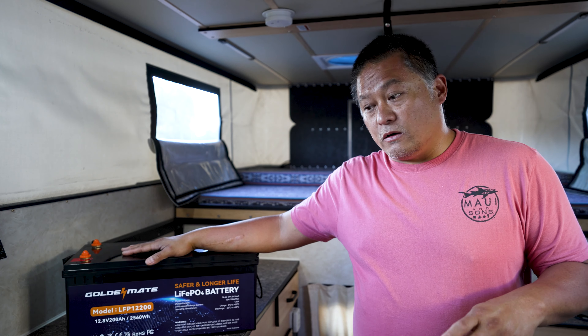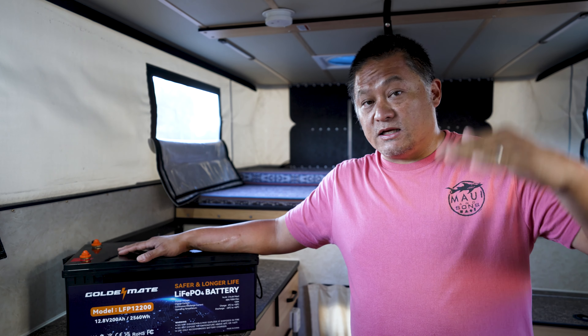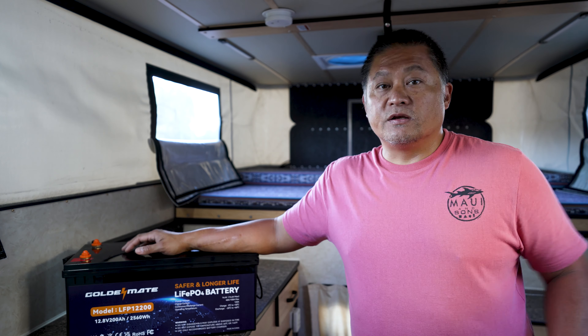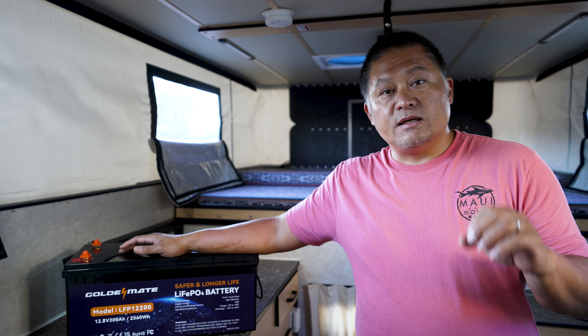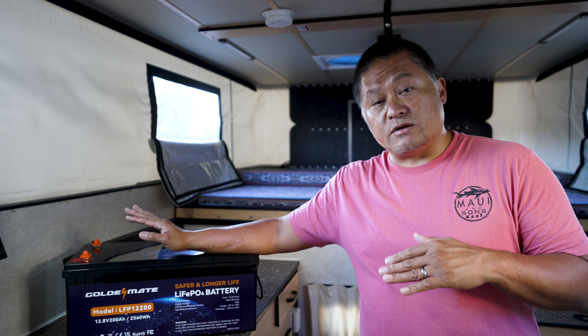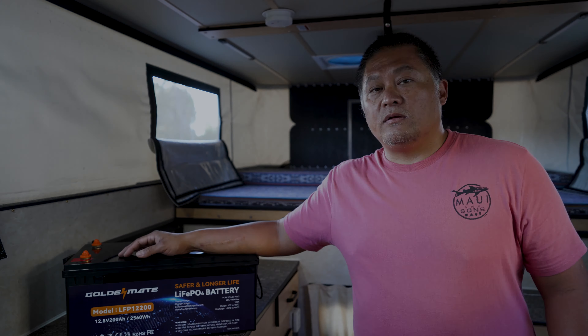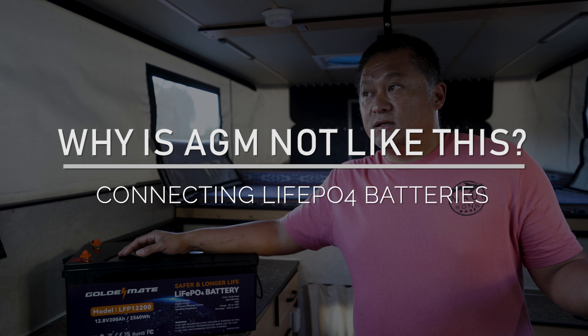These situations come down to what the BMS — the battery management system — inside these lithium iron phosphate batteries is doing. The BMS monitors individual cell voltage: just like you have multiple packs in your battery bank, each pack has individual cells being monitored. The BMS cuts off charge or discharge when any cell goes too high or too low. Having the same make and model ensures identical BMS units programmed the same way, with the same voltage cutoffs at both the top and bottom ends.